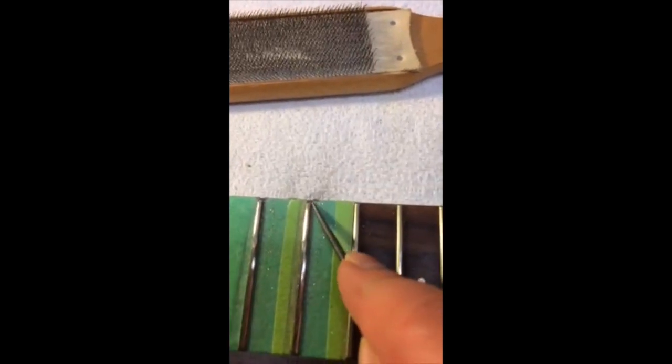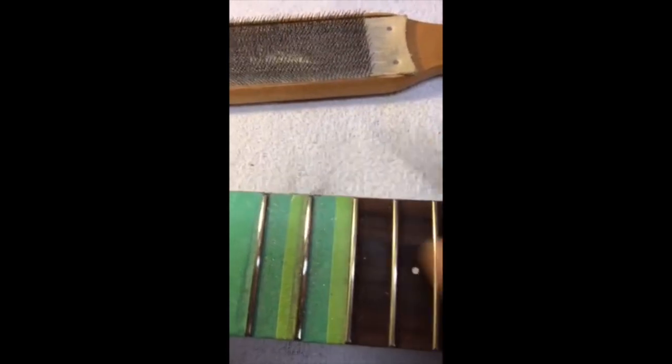I often take a little needle file like this, and go into the corner, rotating it in a spinning motion to remove that sharp edge. Failing that, you can just continue using the standard triangular file and blend those corners out as I was showing you earlier in the video. This kind of technique works very well too, and then of course you can go over the tops to polish them, blend them and sand them.